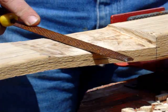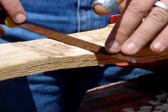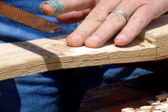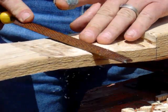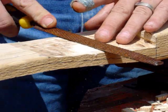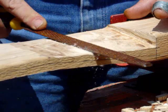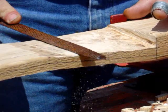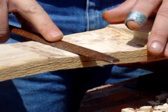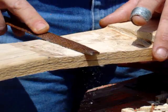A rasp going across the grain runs this way, rasp this way. You can see it kind of rocks across here — it's got a high spot here. You can use a rasp because it's straight and flat on one side. You can sit there and get this the way you want it. Feeling where it's sitting by rocking it can tell you where you're fixing it.